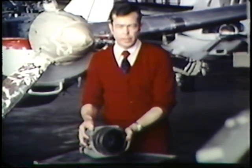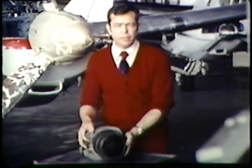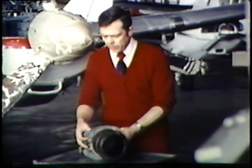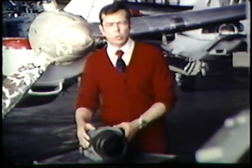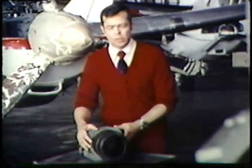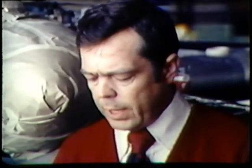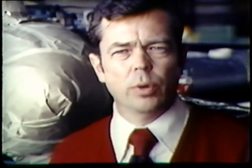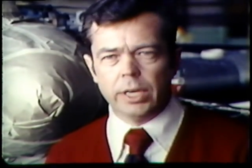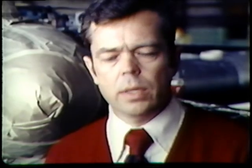This is a typical example of an aircraft engine that's been left in storage for a period of time. The cylinder walls have rusted, causing pits and damage internally, as oil drains away from the cylinder walls allowing moisture to enter and corrode the cylinders. One method of preventive maintenance is to remove the upper spark plugs, rotate the engine, and spray oil internally into the cylinders to coat the walls — probably the best measure for preventive maintenance if an aircraft is going to be stored.